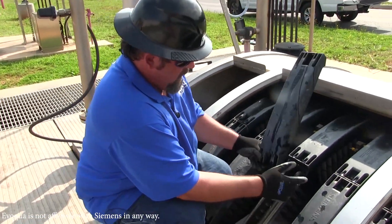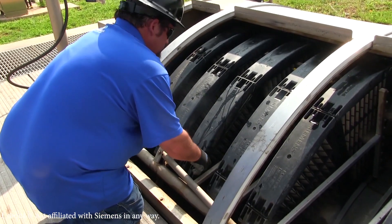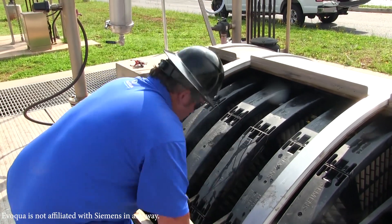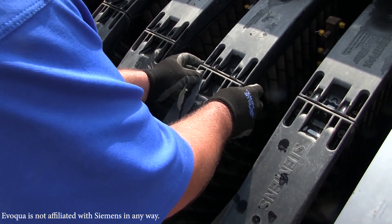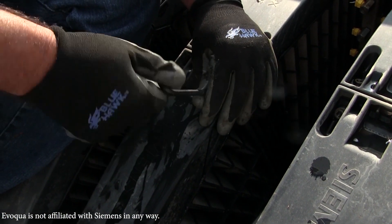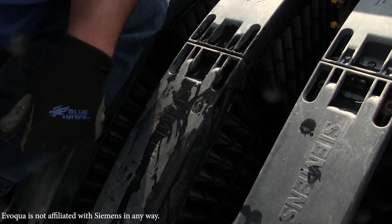To reinstall the cap, I like to hold my thumbs over the bolts. Start at the bottom, get them in the holes. You don't really have to worry about the nuts — the nuts are actually in a cavity here, and typically they don't fall out unless they've been removed numerous times. Once you get the bottom bolts in, pick the top up just a little bit, hold those two with your thumbs, align them with the holes, and pop the cap in place. We want to get them good and snug to prevent any leaks. Before you put any real pressure on any of the bolts, it's always good practice to make sure all the bolts are started first.